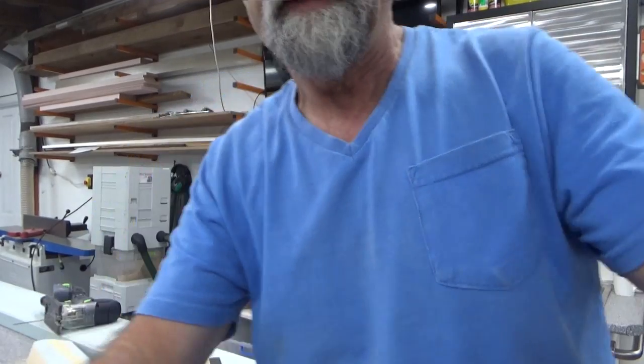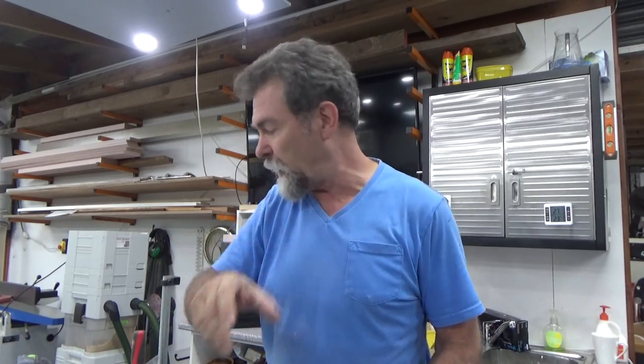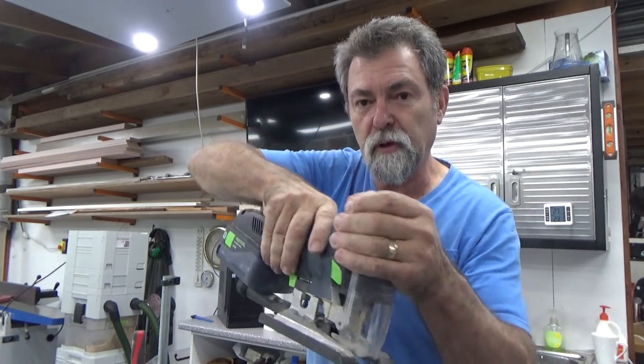There you go — that was a super short one and it just goes to show how easy it is. I do not use dust extraction when I use the jigsaw. I make sure that my leading hand, the one on the front of the saw, is not pulling the saw left or right. You have to really concentrate on that because it will happen automatically — you will start to pull the saw around the corner. Don't ever do that. Push from the back, equal pressure on the back of the saw forcing it forwards. Don't try and pull it around the corner that way. Thanks for watching, keep on coming back, and I shall see you next time. Bye bye.